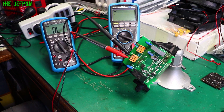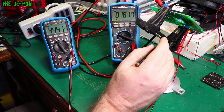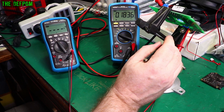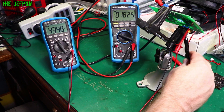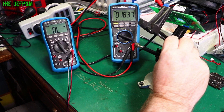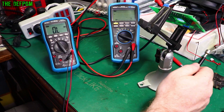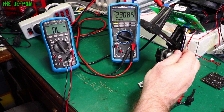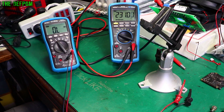Okay, let's take the other switch and try this one. That is switching — barely — but when it is switching the resistance looks okay. So we'll take these off, power it up again, and try to get this one to switch whilst I've got it on. Nothing happening. That's curious — could it be the relay is jammed? I heard a click though — sure I heard a click from that relay. Yeah, the relay is clicking. So the next thing I'll do is look at the voltage coming out of this and clip onto the relay legs, then try activating those reed switches again.